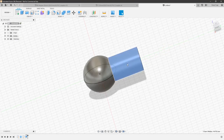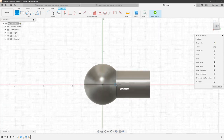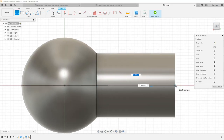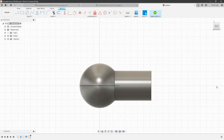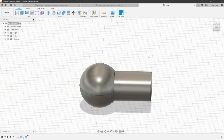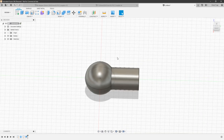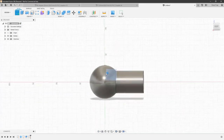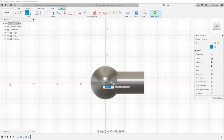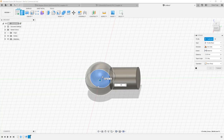That 41 millimeters works out to 29 millimeters extending out from the sphere — I want it long enough to go into the piece of conduit a fair bit of ways, just my personal preference. Now we're going to make the original triple-90 corner. New sketch, click on this profile — we have one going this way, now we'll do a circle at 21.43 millimeters again. Finish the sketch, extrude 41 millimeters, change it from Cut to Join, and hit OK.